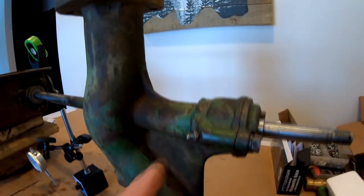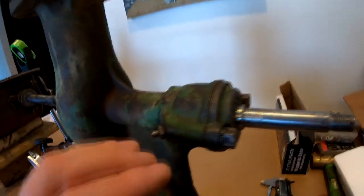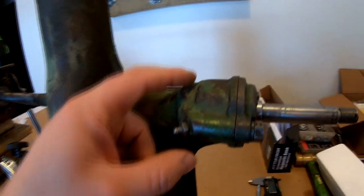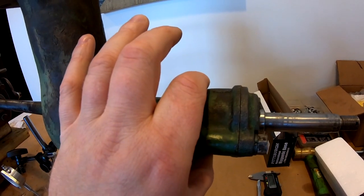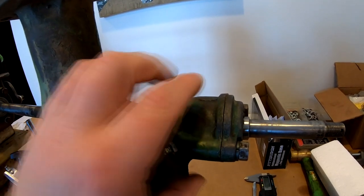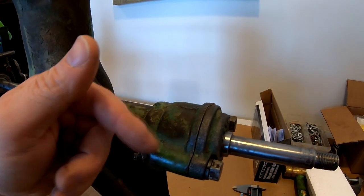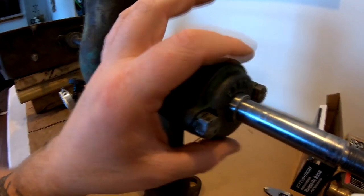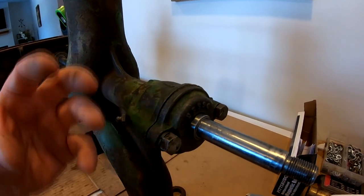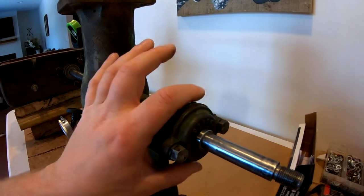The front end of the water pipe is set up similarly to the felt system and steel cup retainers used for the rear section of the fan shaft and both ends of the governor. There's a steel cup in the rear portion that holds a felt, with the cup open-ended toward the rear of the fan shaft. The easiest way to install it is to put the felt inside the cup and drive the cup into the front of the fan shaft support. Then the bearing goes inside the casting, and the retainer cap also has a steel cup and felt with the cup toward the rear.